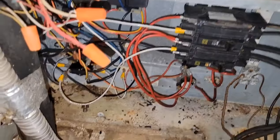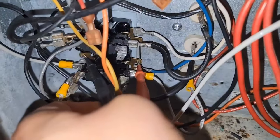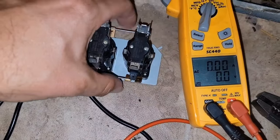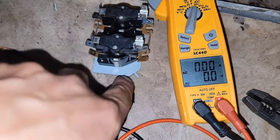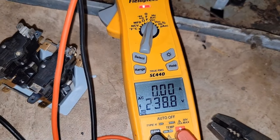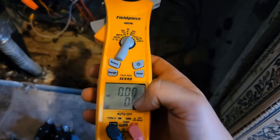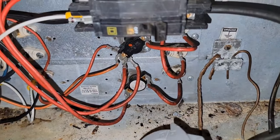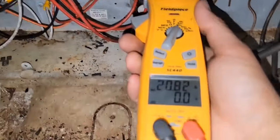Turn the unit on heating. Get my meter. We've got 25 volts to the coil. Now we're going to measure the amp draw on all three heaters. This right here is the coil - I was putting one meter lead here and one meter lead here. So 25 volts here, and then 240 volts here. See right there - 238 volts. Put it on volts AC, hit select, and now we are going to measure the amps of these heaters. 20 amps. 20 amps.